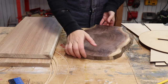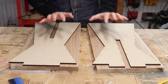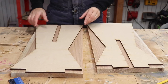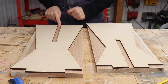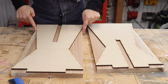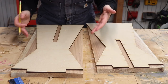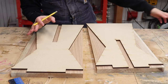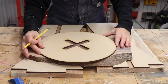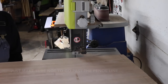Before I can use a flush cut trim bit to use these templates, I first want to trace them out onto my pieces and then cut away most of the excess, so that the flush trim bit will do the best job it possibly can. Note the difference between the two base pieces — one has a slot on the top, one has a slot on the bottom. I'm also going to hold off on tracing out the sides, as these templates are pretty versatile. You can make it with angled sides or whatever shaped sides you want. I'm also going to trace out the X onto the slab. These cuts don't need to be perfect because they'll be cleaned up with the flush trim bit afterwards — this is just clearing out the majority of the waste.